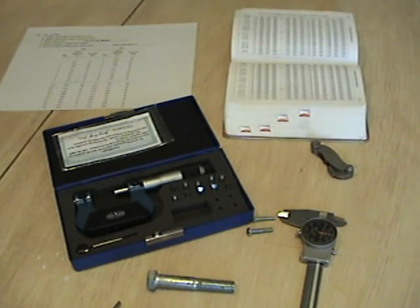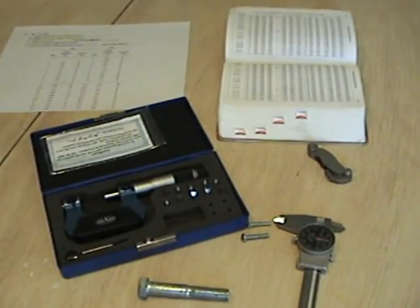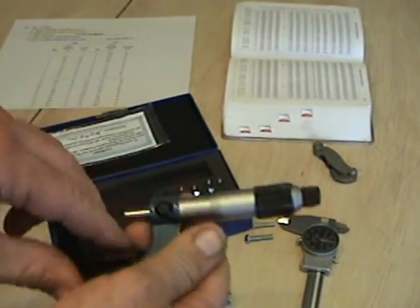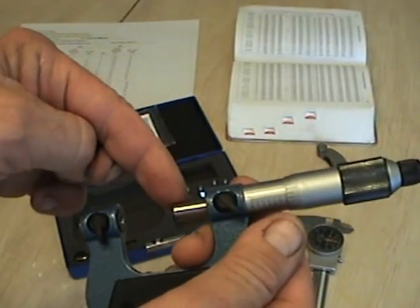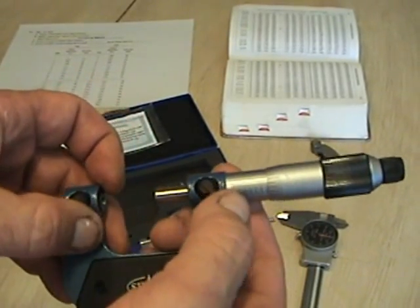This video is going to be about the screw thread mic. In the video you saw three types of screw thread mics. You saw the comparator mic, which has a 60-degree anvil and spindle — 60 degrees at each end. It was used to compare one thread to another. That's all it was for.